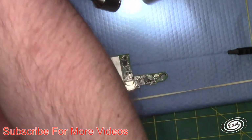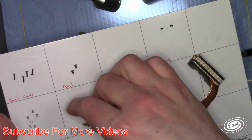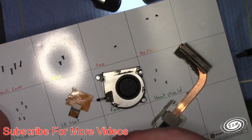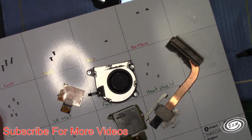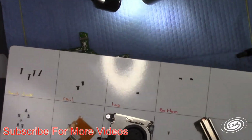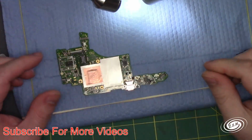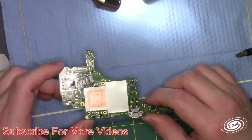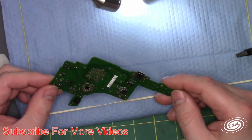I've tested a lot of these components. The SD card reader is good. The game cartridge module is good and very clean inside. And the memory is good. So all that's good. So I could use those as known goods when testing a broken Switch. So, like I said, if I can get this board to work, I think keeping it as a known good board would probably be advantageous to me.